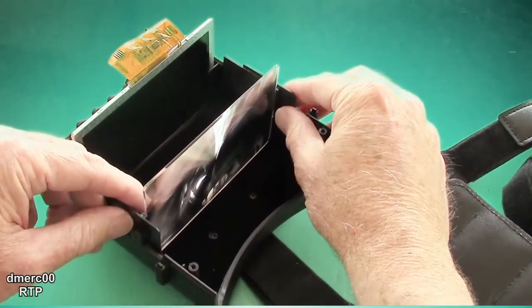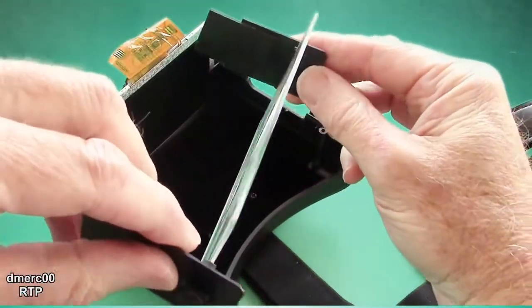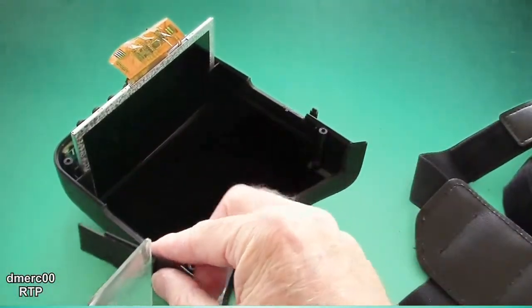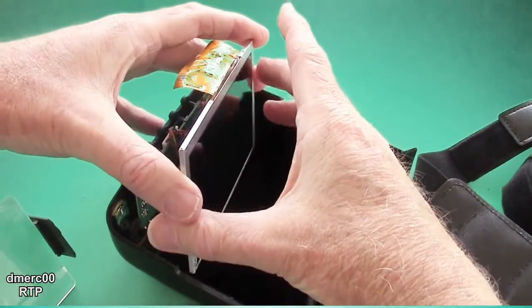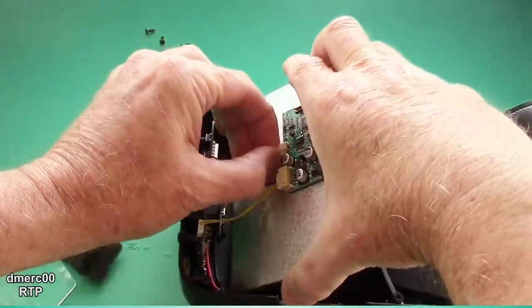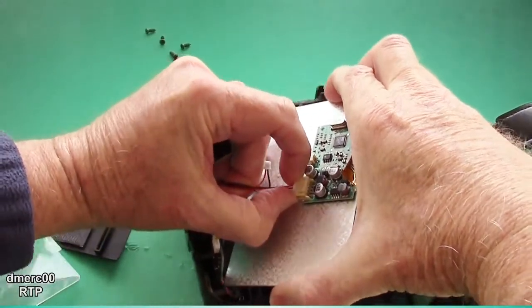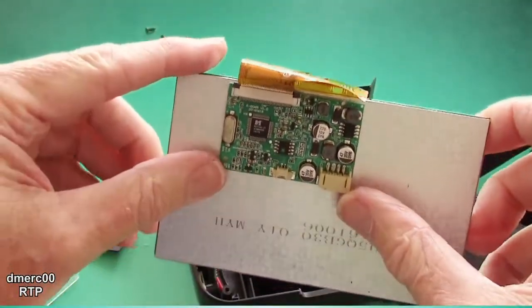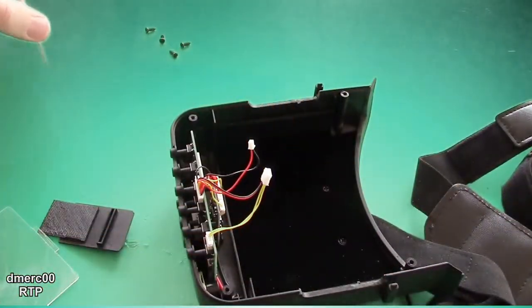The first thing is there's a Fresnel lens right there — it has those circular lines going around for magnification. There are a couple of sliders, which I've modified and I'll show you in a minute. Then you have your display section right here, which I can remove. There are actually two cables right back here that you can just pull out to remove the display — this bigger one's a little harder to get out, you usually need a screwdriver to pry it. So there's the display. This is the display driver board right here on the back, and there's a ribbon cable going from the display to that. It comes off as a separate piece.